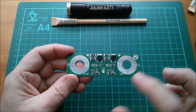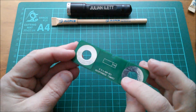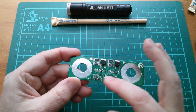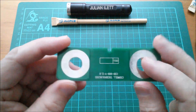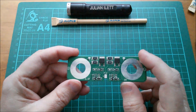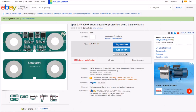I was expecting a more modern circuit which would switch in the protection suddenly, not gradually. There's no heat sinking on those transistors — no copper in this area, nothing on the back either, you can see light straight through. There's no thermal dissipation for these, so obviously not expecting many watts to be flowing through those.